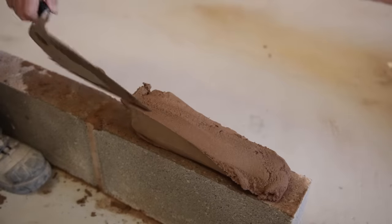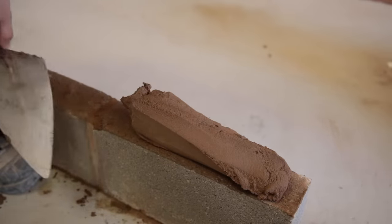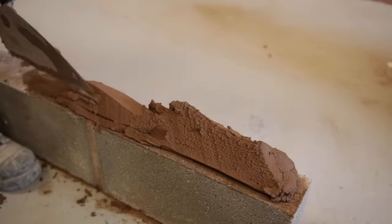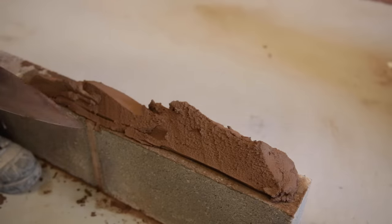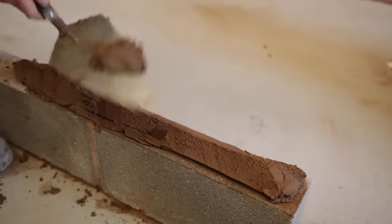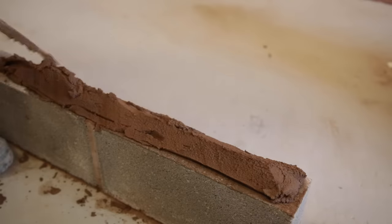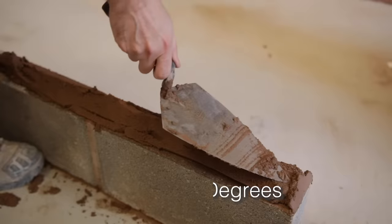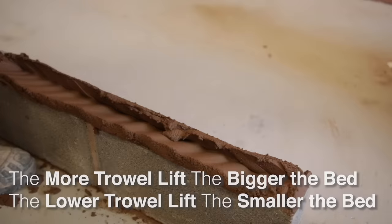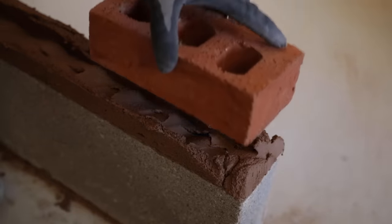So we're back and twist again — you're not going really fast, it's just a gentle motion, give yourself some time. Make sure all the mortar is on the centre of the bricks or blocks. Scrape the right side and collect, back down with the same action, then mirror that — collecting with the left side of the trowel. Remember covering all material visible so all you can see is mortar. Then we're ready to furrow our bed, going parallel, out about 45 degrees. And then we've got a nice bed of mortar to push our brick down onto.